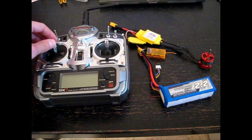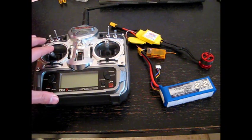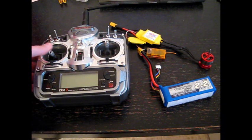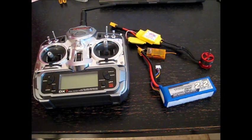To save the submenu I will push the throttle all the way back up again, and to finish and save all the programming I will push the throttle all the way down and then the controller saves the program that I programmed. So be sure to read the PDF attached to this video — all is written there and this is only a demonstration.